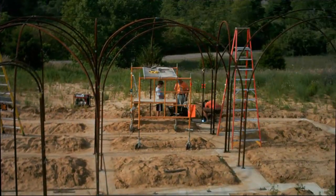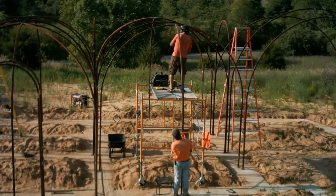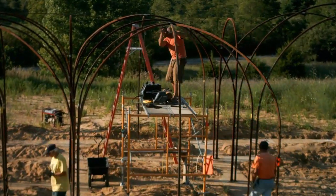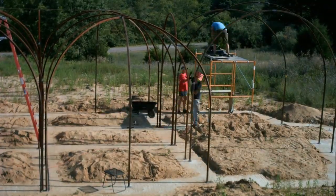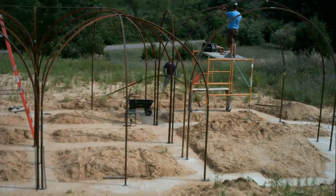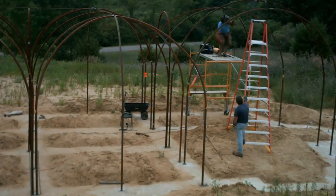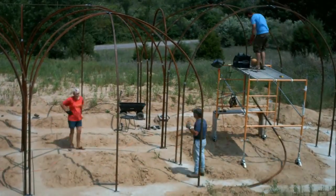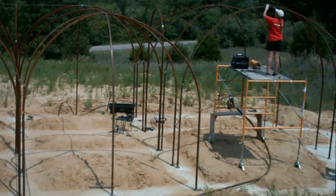When you only see a couple of us working on this, the rest are working on the ICF wall, but we call them back when we need more hands. This third section is a bit wider so the arches needed to be taller, but to keep the steel order simple and to save some money I just used the same sized arches for these miters. I planned to make the extra adjustments as needed — specifically we needed to add about nine inches to the legs here. A little extra planning would have saved some time but it wasn't too big of a deal.